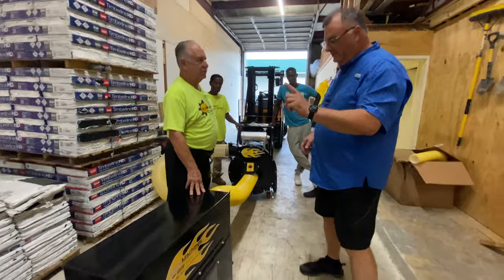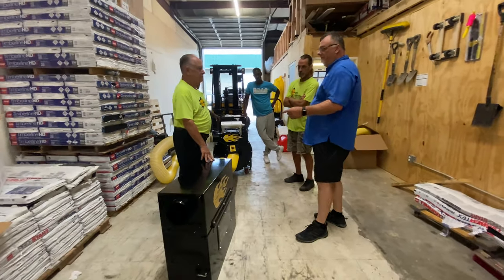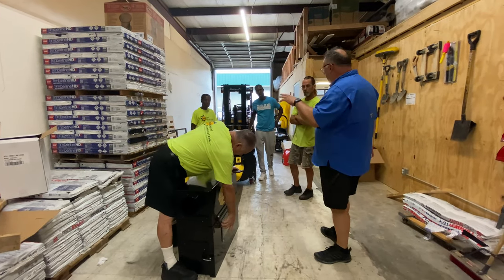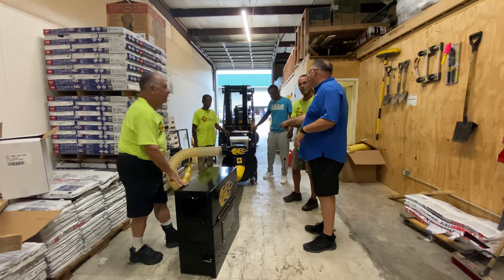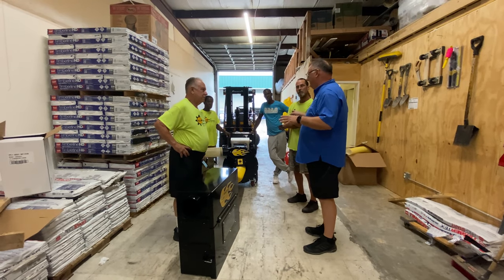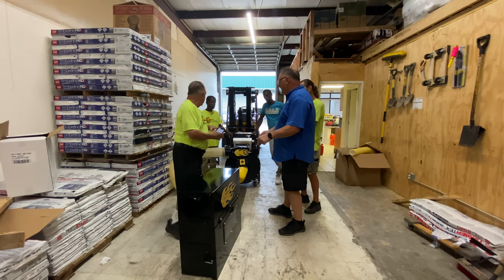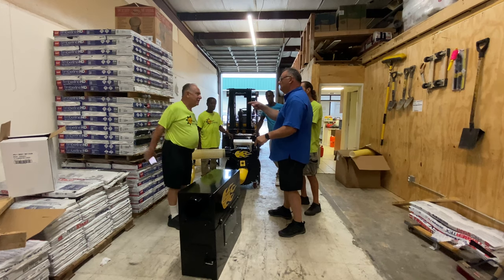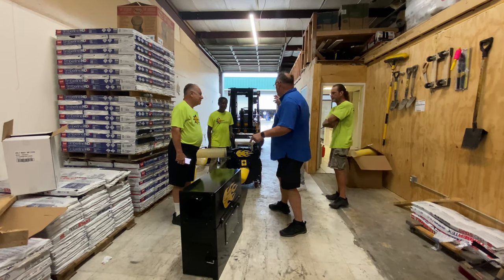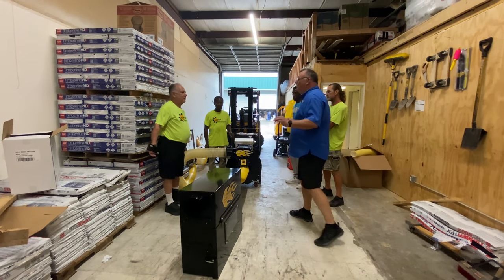From here we go to the vacuum saver. This is going to collect all the debris coming into the machine. It does two things: number one, it collects all that debris and keeps your machine safe. But even more importantly, it keeps your employees safe — because nails will come in, they'll get collected here, and we won't have broken bags. It protects your bags and it protects you. A nail flying through here will go right through you.